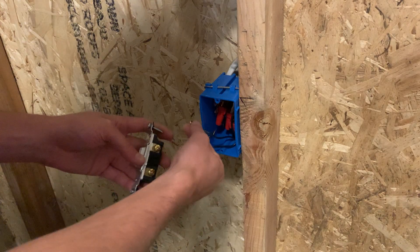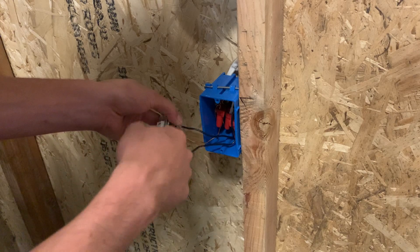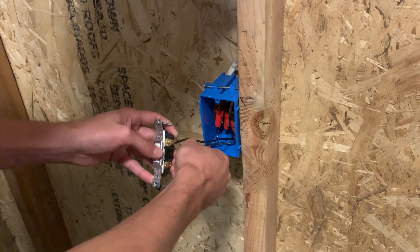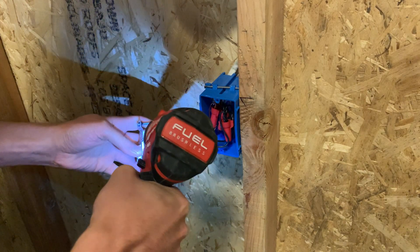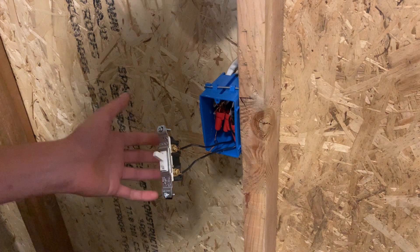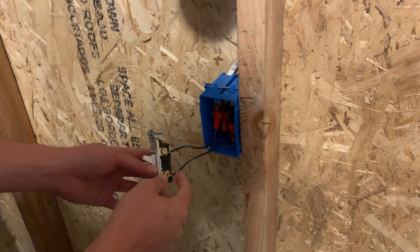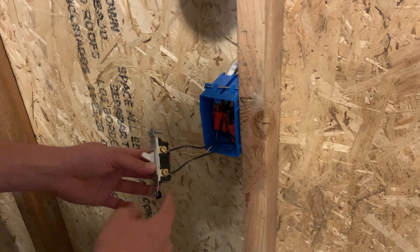The power will be sitting on one of these screws, whichever one you pick. If this is your power wire, the power will be sitting here, and when you flip the switch it'll send the power through the switch and turn the light on. It does the same thing on either wire, so just pick one and stick them on. Also, make sure that when you curl your pigtails, you curl it so that when you tighten the screw down, it tightens it tighter. If you flip the curl backwards, when you tighten it, it's going to back the wire out of the screw. So always tighten it down to the right side.